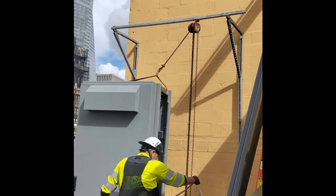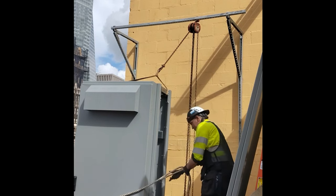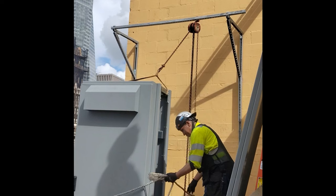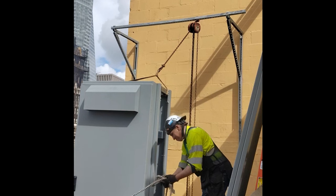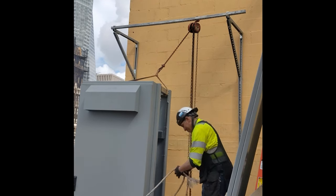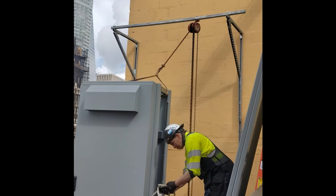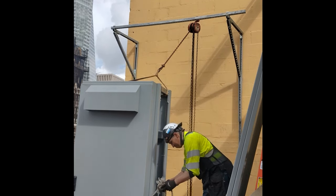If you're an apprentice, I'm trying to take the intimidation away from installing switch gear. Other tools you might want that aren't shown here: J bars, or anything that can help you get under the actual gear to lift it up or slide it over. Good dollies are something you're going to need. You can see me tying off the rope — I put the rope around the gear and tie it off to a beam so it does not swing around anywhere.